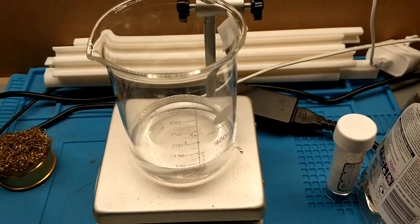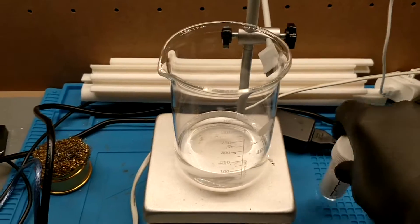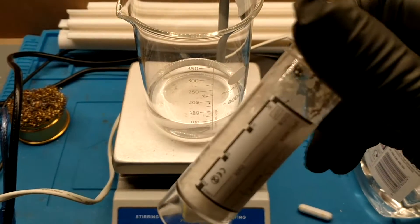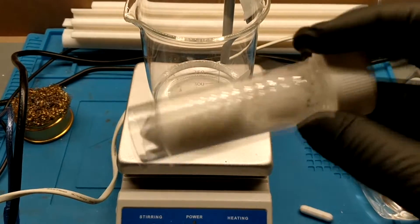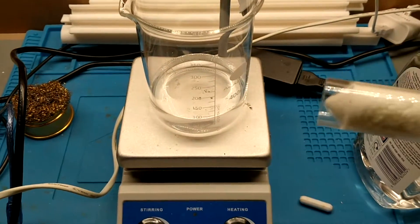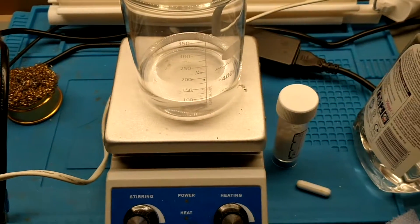What we're going to be using today to make thermoplastic starch is potato starch, which I've made from some potatoes. We're going to be mixing this with acetic acid — that's vinegar — and that's going to partially break up the chains in the starch, which are mainly amylose and amylopectin. The acetic acid is going to break down the amylopectin to dextrin and amylose, which make a biodegradable plastic.